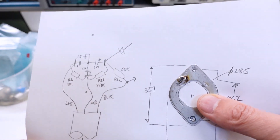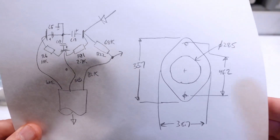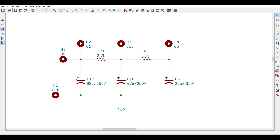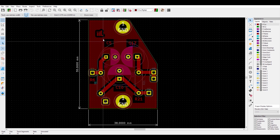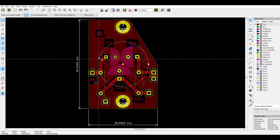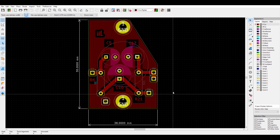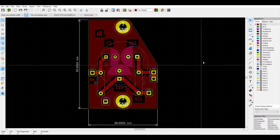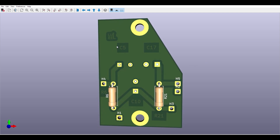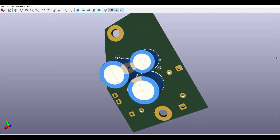I decided to go the custom PC board route. I started by making a simple sketch of the components and wiring connections in that area, then made a tracing of the capacitor mounting flange and measured key dimensions. I whipped up a quick schematic in KiCAD — just the three capacitors plus R6 and R21. The board layout uses 2mm wide traces with legend text directly on the copper layer. There's a 28mm diameter circle marking the boundary the three electrolytics must stay within to fit through the 28.5mm diameter hole in the chassis. And just like George, I'm leaving my own little bit of personalization in my projects.